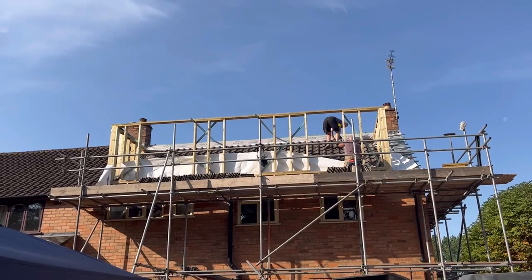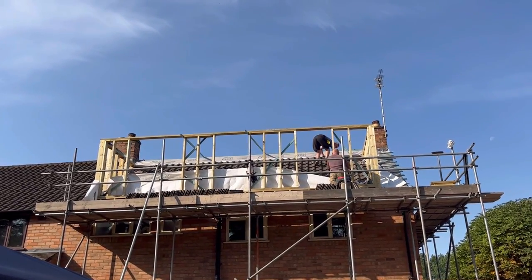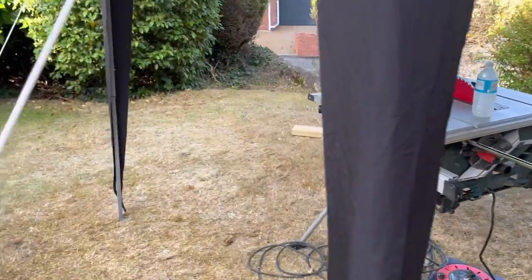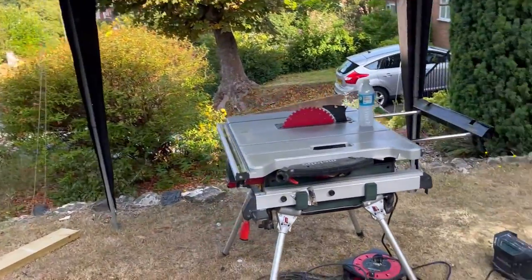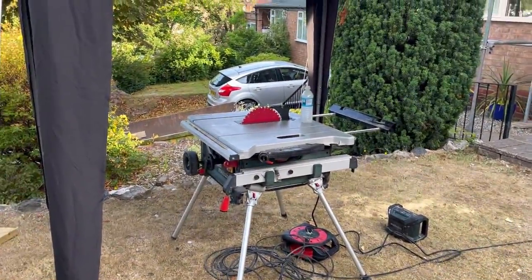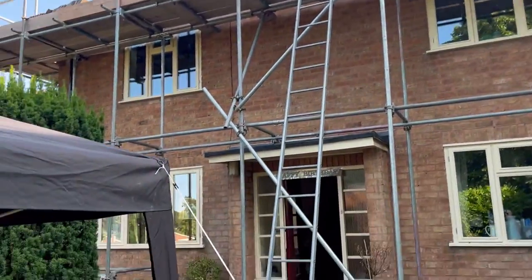It's a hot one so I don't know how much footage we'll get, because I'm not going to leave my camera sitting around today, but let's crack on with it. I've got my saw set up ready to put the timbers inside the web of the steel — I think it was 135 — and we'll get them cut while the lads are stripping the rear roof off.